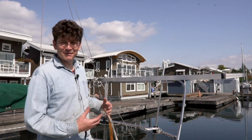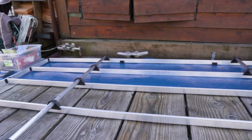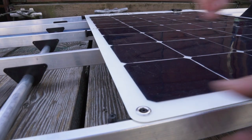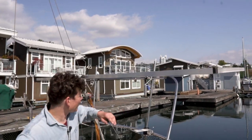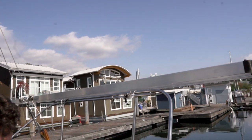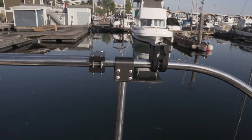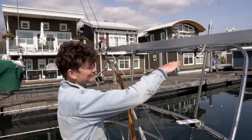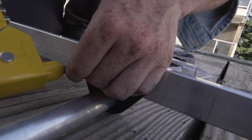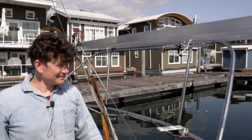We started working on this about a week ago and are now at the day before departure, scrambling to get it all done. Our solar plan was 1500 watts but we're probably going to be more like 1300 given the time constraints. We've created our own little arch structure in the back of the cockpit to support the large rear panel. Everything is place-held so we can cut tubes to size; we've 3D printed mounting clamps matching all the tube diameters and angles, allowing installation without any welding. The top panel pivots forwards and backwards to aim at the sun — really lightweight and sturdy.